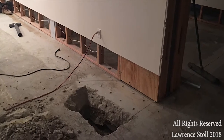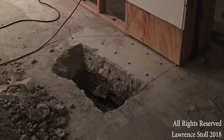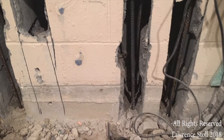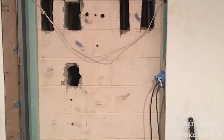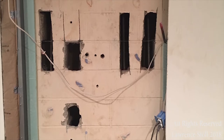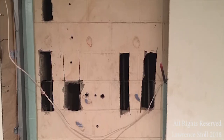We're putting number five rebar into this building — a cage. You can see the wall there. The columns are actually going to be buried into that wall, so our footing is actually going to be up underneath of that. Here we're chopping out the foundation wall. It was a 12-inch block wall, needed to be reinforced with number five rebar and core fill. The engineer wanted that to be a solid wall so the beams would not be crushing the foundation.